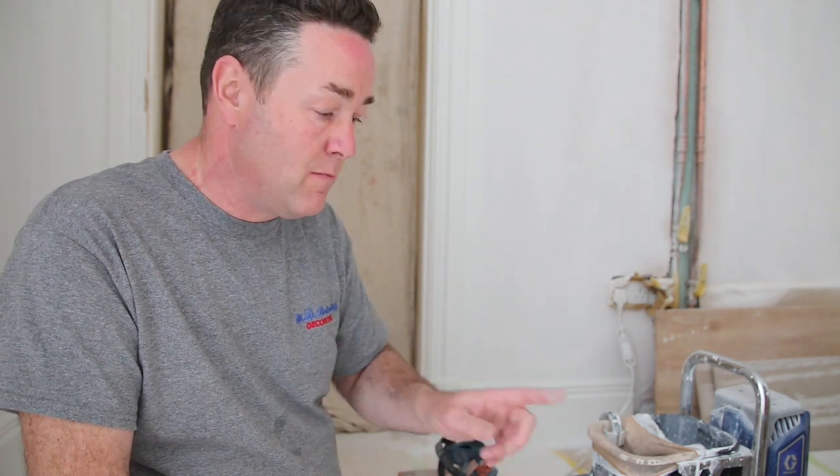The thing is, you've got to make sure that you get your paint consistency right, because if your paint's too thick, you'll be up in your pressure. You don't want to do that. You want to be spraying at lower pressure so you haven't got the overspray and you haven't got clouds of spray dust in the air. Also, don't be spraying too close to the surface, because you can get bounced back off that. But we're not going on about spray techniques like that now, we're just talking about the five tips that are going to help you improve your spraying.